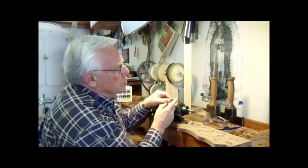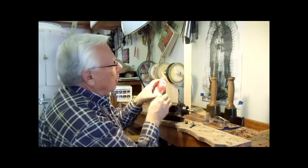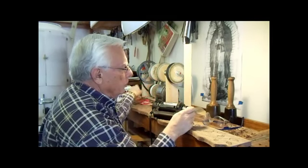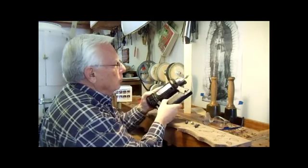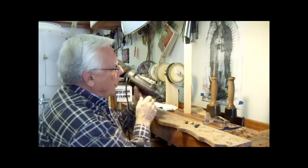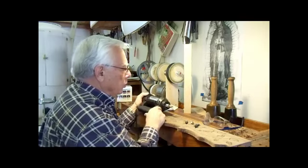They're carbide, so they have a carbide insert. They stay sharp very long. The ones that I get are from Eagle, that's the brand name, but other people that make router bits, you can get them from them also. But any 1/4-inch shank will fit in the RotoZip. The RotoZip comes with a base that you can regulate how deep you're going to go. I just run it by hand. What I'd like to do is show you some of the things I can do with the RotoZip.